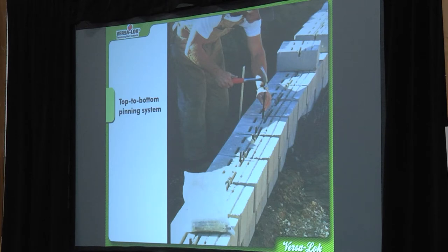Make sure that as you're setting these blocks, you don't just drop the block right where it goes and pin it. You've got to get that block worked in — a little back-and-forth action where you slide it back and forth and score up the bottom and the top. That's going to make sure you don't get rockers where blocks are tipping because you've got a pebble underneath. Slide it back and forth, score it up, get it nice and clean on the base. It's a lot easier to catch it on that course than three courses up. Shims are for the weak — just do it right to begin with.